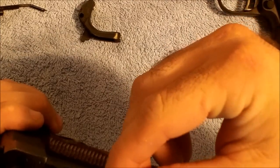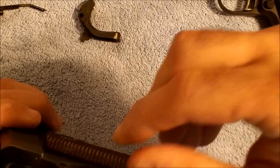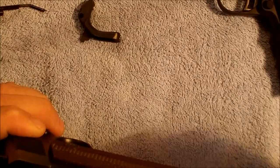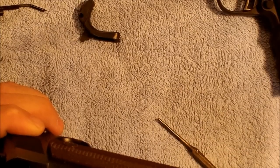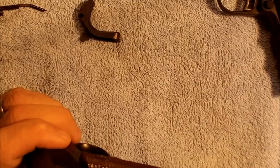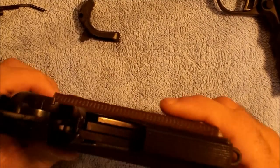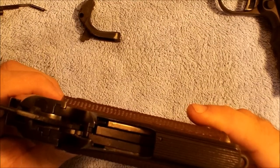When you're reassembling, the one thing you want to do is engage that spring into the notch and then just set that spring on top. As you go in, you can see that the spring leg is on top of the sear where it should be. As your mainspring housing goes into place, you can see it goes down and begins to engage the disconnector. That's how your sear spring goes in and how it's adjusted.